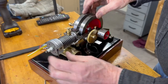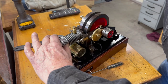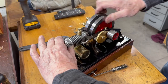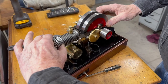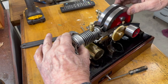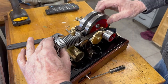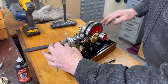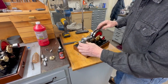With this off and the spark plug in, I just hold my thumb over there and you can see it has compression. It has good vacuum too, so you know the rings are good — it won't pull out of there. If I let it go down to bottom dead center and plug it up, you can hardly push it up in there. You can hear the air pop out of there. That's the way to check valves, and it'll also tell you that your seal on your spark plug and your cylinder head is good.